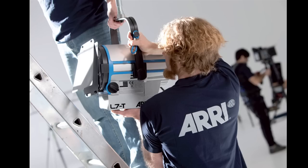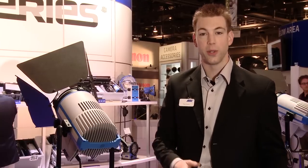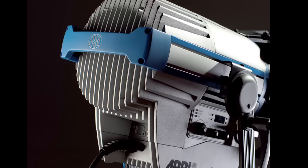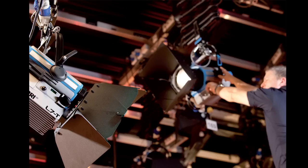The fixture is also very robust. Our conventional units are very well known in the industry for how strong they are, and we know that our conventional lighting products are used on set in very harsh environments — used in studios, often in ways that aren't so well protected. So we want to make sure that with an LED product they didn't have to change their modes of operation or protect it more than they would a conventional product. One of the things we're most proud of is that we were able to achieve a completely passive cooling system. In television studios, customers told us that fan noise is a big problem and it's prevented them from using LED products in the past. So we developed a completely silent passive cooling system — there are no fans in the fixture. If you hang 50 of them in a grid, you won't be hearing a bunch of fans buzzing in your microphones.